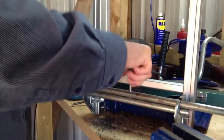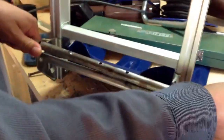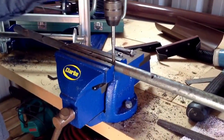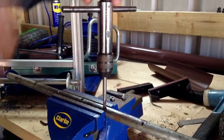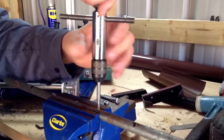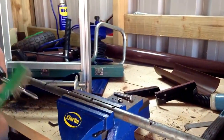What things will you need to do? Well, drilling is quite difficult. If you don't know what you're doing, just take your time and accept that you've got to do one at a time. I'm just checking these holes are threaded properly — I've just got to check this one's threaded through, so we'll just run this through. This is a tap and die set — this is a tap and this is a tap holder. They come in different shapes and sizes, but basically it's a way of creating a hole with a thread so you can put the bolt through. This is a very strong way of joining two shafts together. Every time this tap goes through, you create a thread gently, and you then clean the debris off like this.